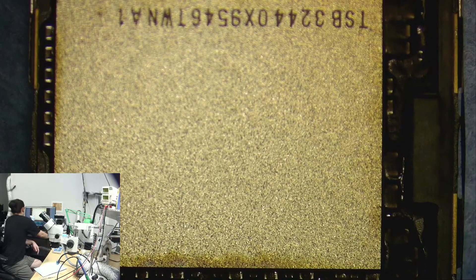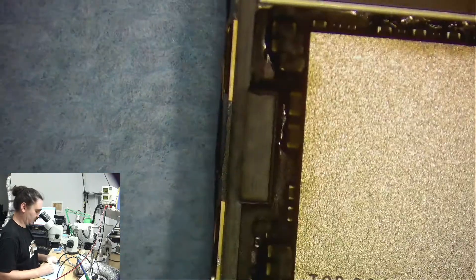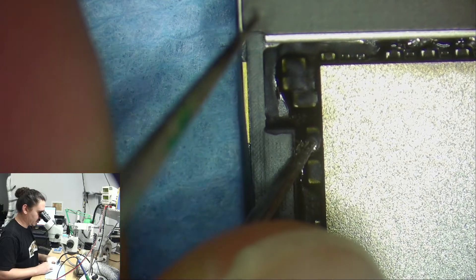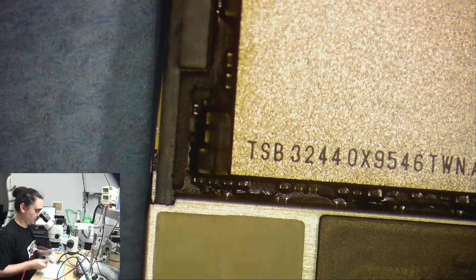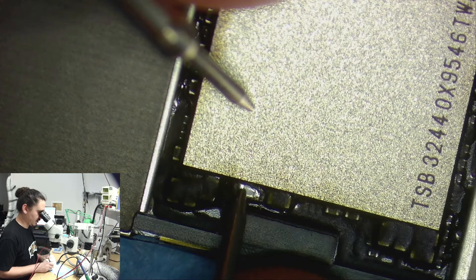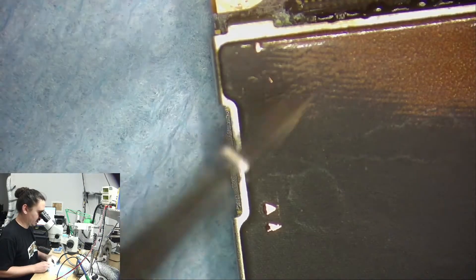Here's my NAND chip. Let me just make sure I don't have a short on there first. I believe I have some 1V8 power lines right here, and that could also be causing this problem. I'll look at ZXW so I can see what lines I'm working with. After taking a quick look, I have a 1V8 capacitor right here, and that 1V8 line is also on the other side where I saw some of that corrosion. So this line may be shorted — and it is short.